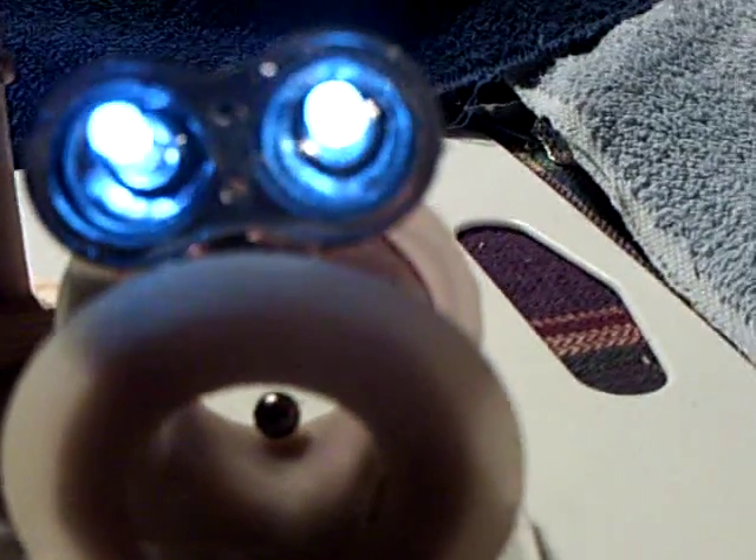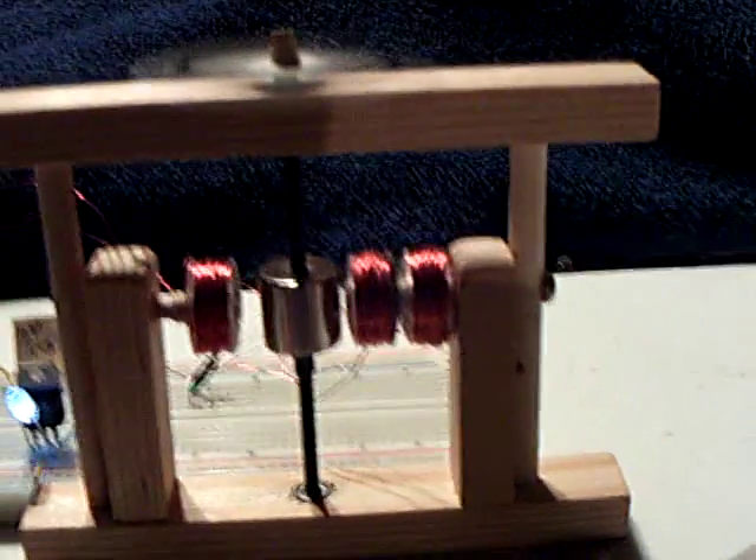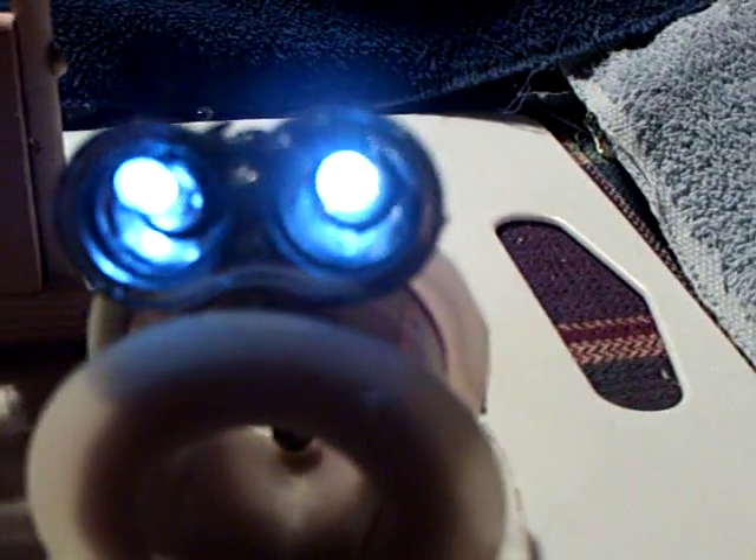Maggie's happy with it. Her ball is spinning up in her mouth — that's how she is operating. She doesn't have any batteries; it's just a coil of wire with a bridge rectifier and a couple of LEDs. That ball is a neodymium sphere, and it spins up inside that coil, creates energy, and drives through the LEDs. That's what I find really interesting — it's being driven remotely through flux lines of magnetism and putting out enough energy to light those LEDs. It's about 2 volts to light them up.